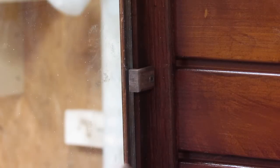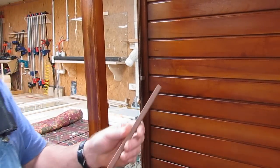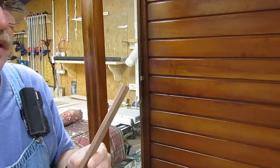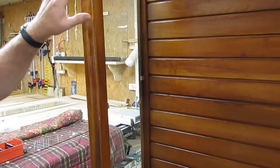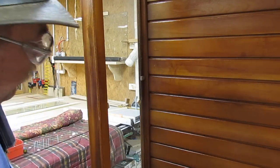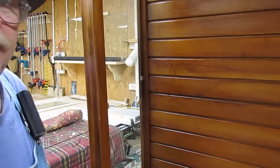This is a custom thing, so they may need to be bigger, smaller, or entirely different size depending on your project. I'm making these out of walnut - just a little bit of contrast, still a dark wood, and it'll look good. We needed to make them out of hardwood so they'd be durable. We'll cut the fit, bore a hole for the screw, and screw them to the frame so it holds the glass in good and tight. If anything ever happens, you can take them out.